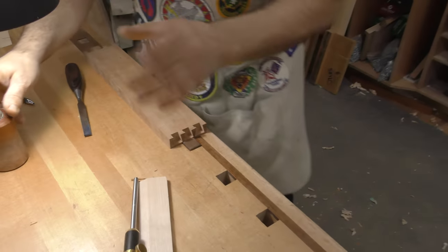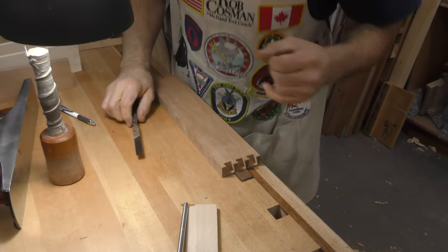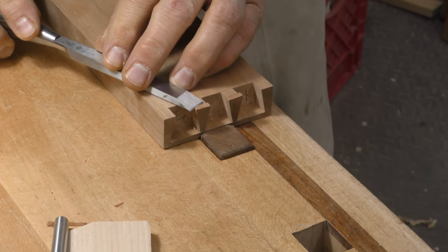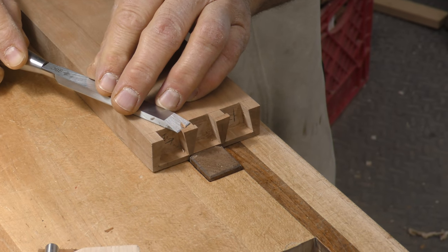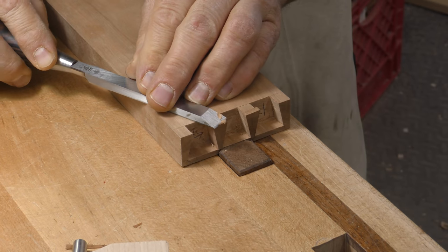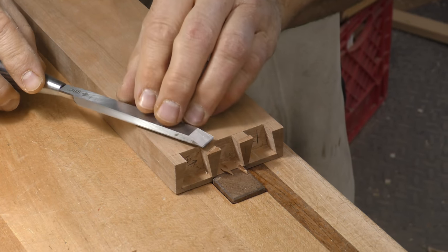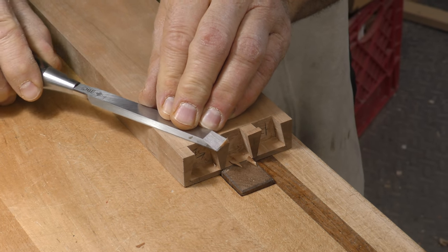But if you've had issues when you're cutting dovetails in pine, that the fibers crush, try this. It's quite amazing how much of an improvement it is. Now, there's always a danger that the grain is going to be going the wrong direction. So, yeah, I'm being particularly careful. I'm relying on an end-grain to end-grain glue joint to hold us on, but you know what? It's not the greatest joint, but it is still... I would be very surprised if any of this work were to knock that off.